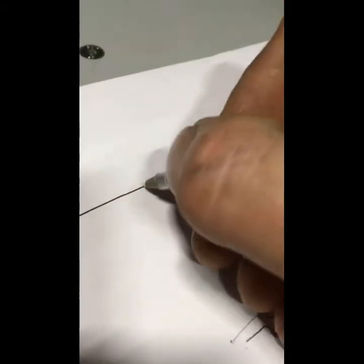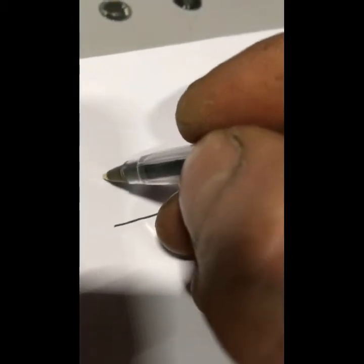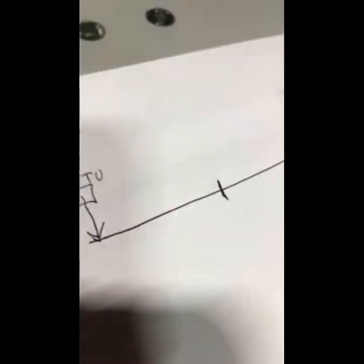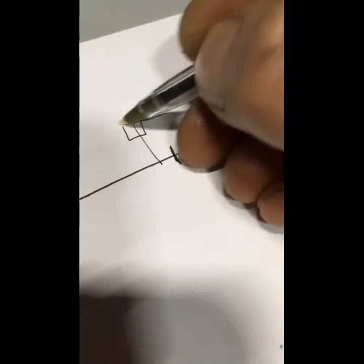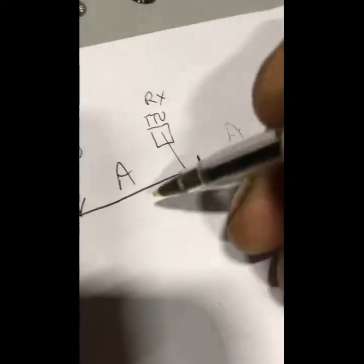Now, as regards to tracks itself, if this is our railway, on a conventional track we'd have a block joint here. With these digital tracks, what we can do is put a feed in from our track tuning unit, and we can have another one at the other end. So this will be the TX, the transmit, and this will be the receive, and we'll call this one, say, frequency A. Now what you don't want to do is put another frequency A here, because, if you can appreciate, these two could bleed through together, especially if we take this tuning unit off here.